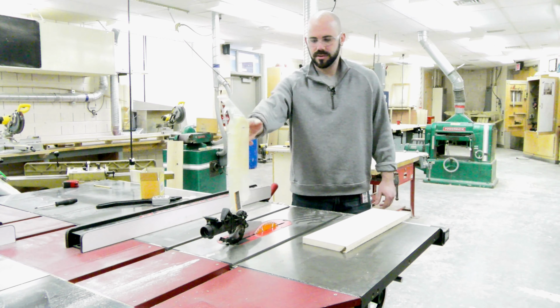So you're making this L, which is allowing this board to slide through your hands, okay? Holding it flat to the table and tight and flat to the fence. Your hand is functioning as a feather board in this particular case, okay? So when I make this cut, what you will notice is I'm going to have my left hand planted, right hand is going to feed the board.